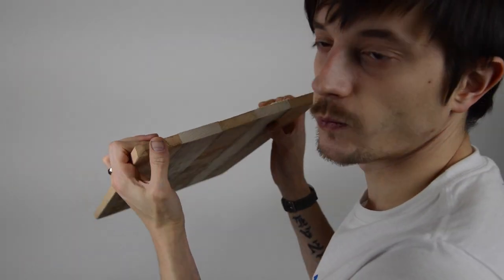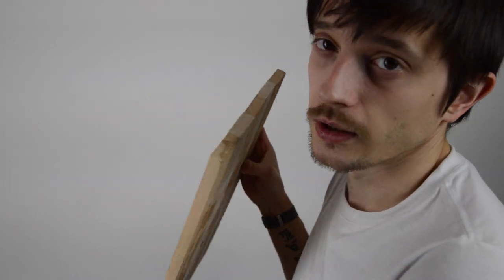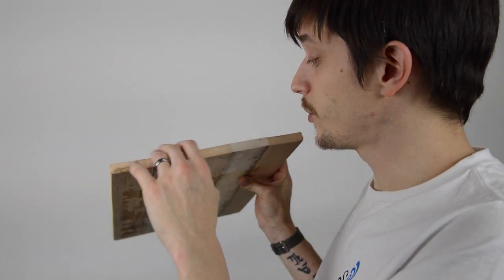And in one of my tests, when I was concerned about this, I actually managed to fully snap a panel by hand. That just shouldn't happen. Again, it might have been a bad joint, might have been bad conditions, but to me, by feel, that doesn't feel right. Now, when I do a glue up with the Titebond, I've done a few now, instantly the improvement is massive. I can feel it, it just feels solid on the panel. You can actually feel it almost grabbing the wood straight away. It just latches on, and just after unclamping these panels with the Titebond, it just feels so much more solid.